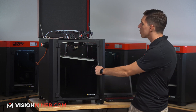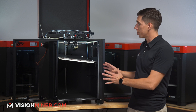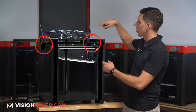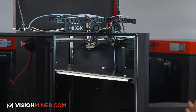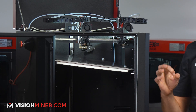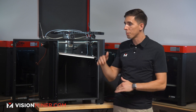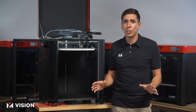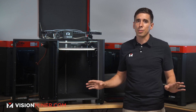Let's talk about the motion system — all the stuff driving this machine. We've got nine motors: four motors driving the X and Y, three motors on the Z-axis which allow it to do that bed dance, and two extruder motors. When you're moving at speed you need lots of torque, power, and stability — and frankly this is pretty overbuilt. They're all 180°C-rated LDO motors. Everything related to the motion system is metal — the mounts, the Z shuttles, the crossbar, and the bed. A lot of the original parts in the machine were 3D printed, but from the years we've spent in high temp printing, everything changes at high temps, and metal is master in this territory.